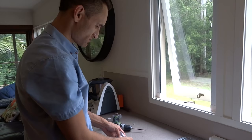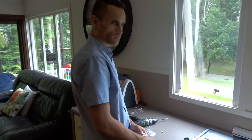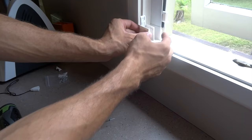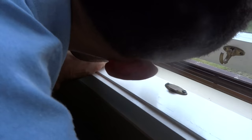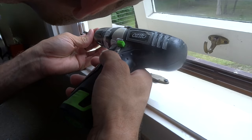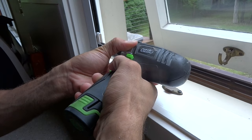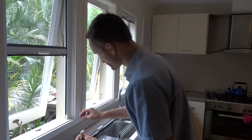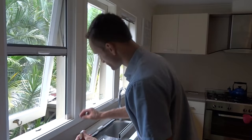We'll just be using the fasteners that are supplied — usually two, three, or maybe four depending on the size of your window. Once again we'll be using this special tool to make your job easier when fastening the track. It's important that the first fastener you put in goes in this hole here, so that little lug will be inside the track. Locate that hole and that's where the first screw will go. Put it into the special tool and lock that one in. I'll continue on and put a couple more fasteners in this track, nice and secure.